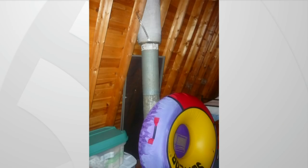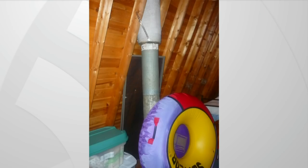One more quick tip: this is a client's attic at their lakeside cabin. At the end of the season they were tossing stuff up there, including a life raft, which ended up against the chimney. Had they lit that fireplace in winter, they would have been smelling burning plastic. So be careful that if you have a pipe going up through your attic there's good clearance all the way around it — don't jam stuff into your attic space.